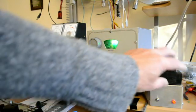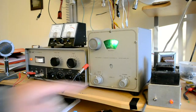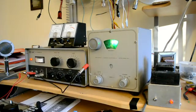And a separate power supply. One of the advantages of a separate power supply is you tend to have a very stable signal, because when you used to get your voltage from a DX40, DX60, DX35, or DX20, it used to chirp like bock, bock, bock. But this keeps it very stable, so you can use this VFO with just about any rig you can think of.